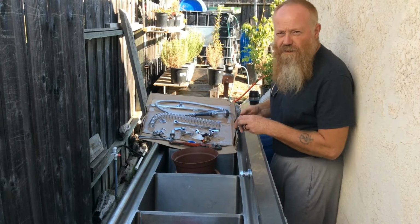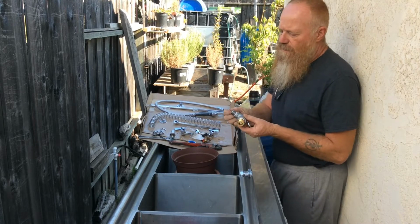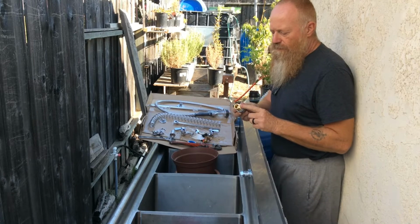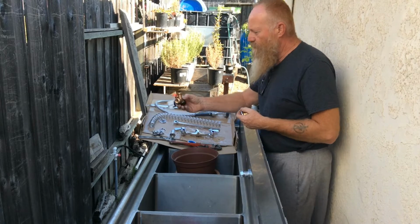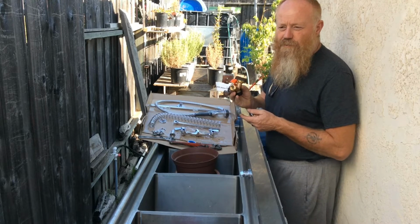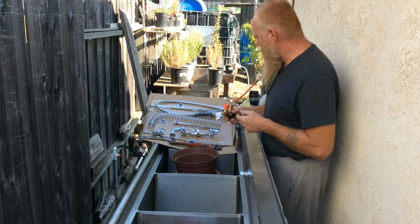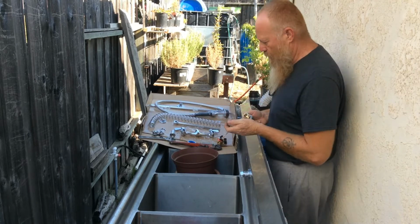When installing this, I wanted to go as simple as possible. So I made just a 90 with a 1/2 inch nipple sticking out with a water faucet spigot onto it. I'll hook a hose up to it, and then we'll just put a combiner onto it to where I get cold water on either side. It will set up to where I can actually do hot and cold if I wanted to later on when we move this to the property. But we'll get this in.